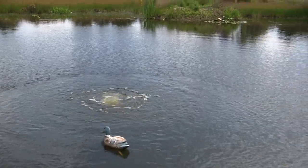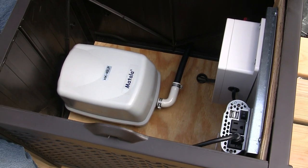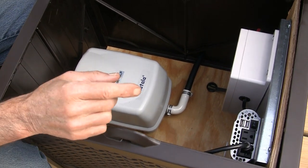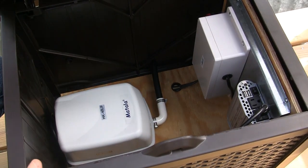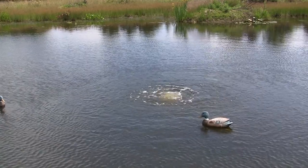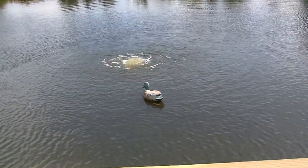Look back up here at the sun — you can see that it's overcast. We've got a dark cloud coming over, and what's going to happen is this might shut down, but it will come back on. Notice how quiet this is? That's a 12-volt, 100-watt solar panel by the way. Now that's getting a black cloud over top of it — watch as this shuts down and restarts. There we go, it's operating. Look at that thing churn. We've got cloud, and she's still bubbling away. Isn't that something?